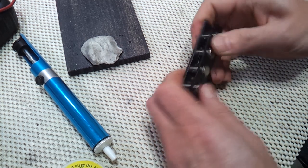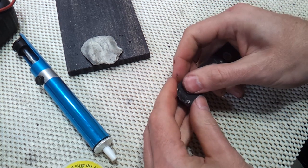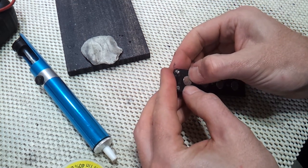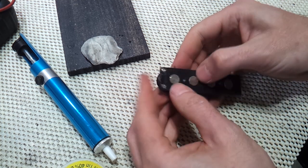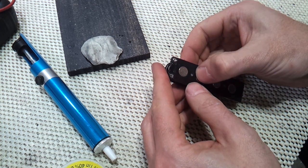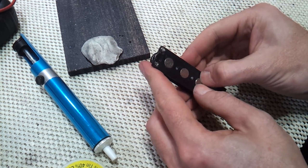So here I'm pushing the pole pieces down so they're slightly proud of that lower side of the bobbin. This way they'll sit right on the magnet. They were actually sitting slightly high, plus they had glue on the bottom of them, so I'm guessing that's why the copper tape wasn't making an ohmic connection with them. I've also had a better idea for earthing these pole pieces anyway, which I'll come to.